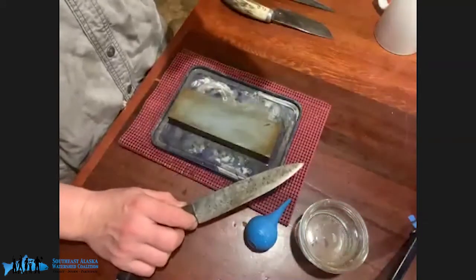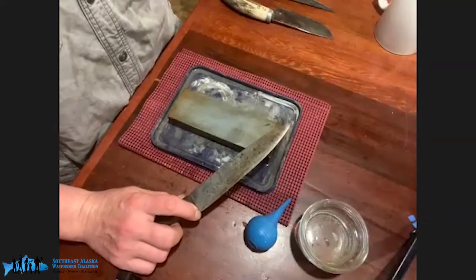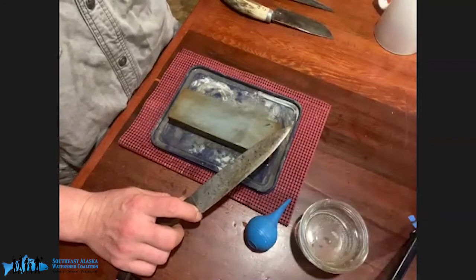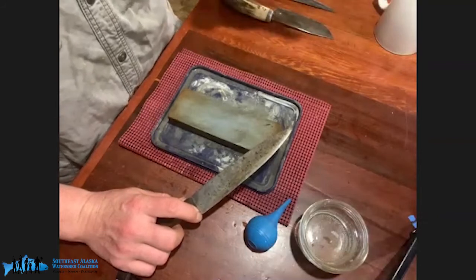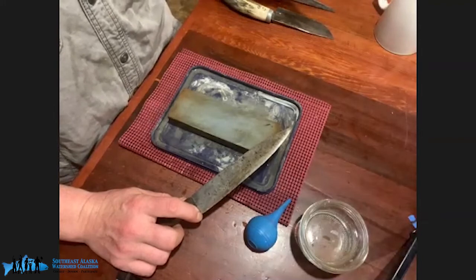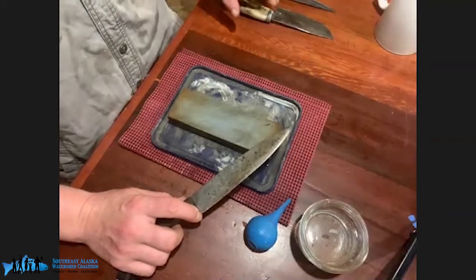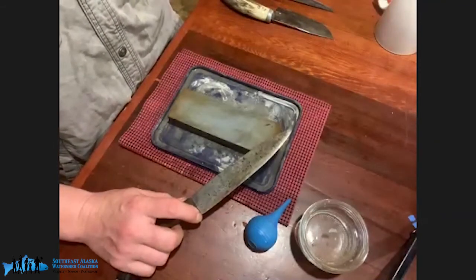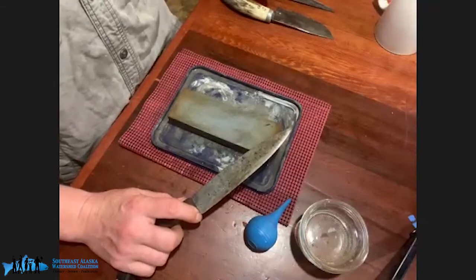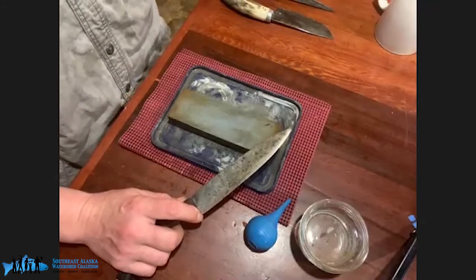If you're using a store-bought knife, they can have some different angles. Store-bought knives will eventually lose a large amount of that angle as you sharpen them, because it was a factory established angle. All of my knives, these are hand forged that I'm using today, they're all high carbon steel, and I make my own angles on them, and I actually use a fairly flat angle.